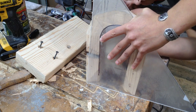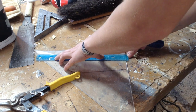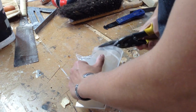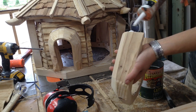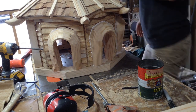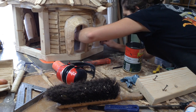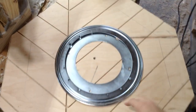I'm adding plexi on the inside of these windows. I had some plexi scraps — a nice way to use small cutoffs that aren't really useful for other projects. I could just cut out the shape with a plexiglass cutter, and for the curved top, if you're careful and cut in small segments, you can cut plexi curves on thin plexi with aviator snips without snapping it — that's how I cut the curve. To attach them, I caulked everything into place so they fit in nicely and the edges are completely closed, then screwed them in from the back side. I also put some clear silicone caulk around the edges to hold them in place.